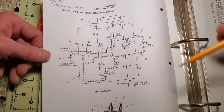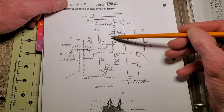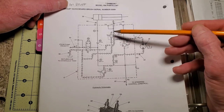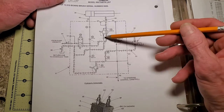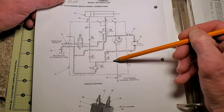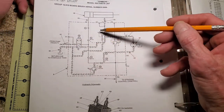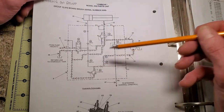Board brush on and steering relief on: you follow the flow over to the board brush arm, extend the arm out. Once it reaches 500 psi, it pushes the valve over allowing pressure reduction. It's also going towards the board brush spinning it. But instead of going out that way, it's built up to 800 psi, opened its valve, so it goes back the other way. So the board brush arm is on and pushed out, the motor is spinning, and steering relief is on. That's probably the scenario when you're in the corner.